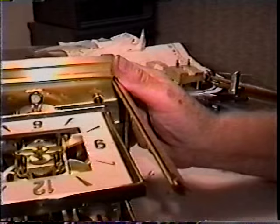Make sure that everything is correct here. This spring here, after you put it on, there's a little chain that comes through here, and it has an adjustable link space. Normally, these will take about 6 or 7 links before you can pin it. But a good test on that is this spring should measure 47 millimeters after you have the plate on. You've got 47 millimeters here. The tension on this is correct.